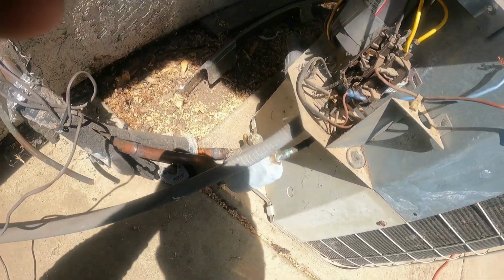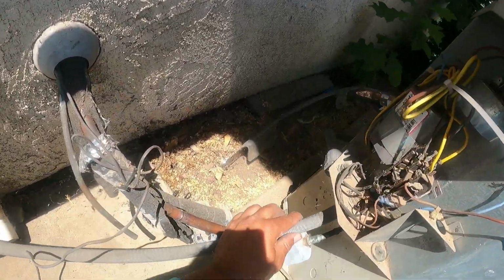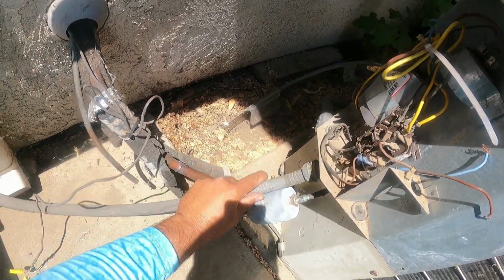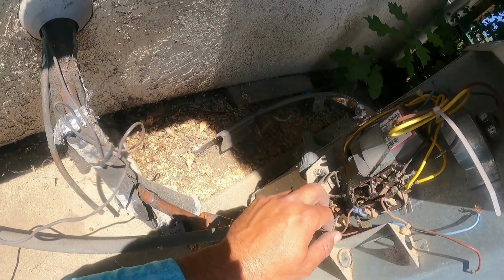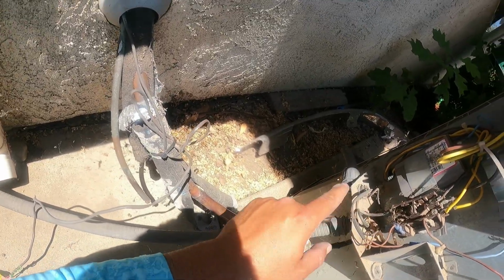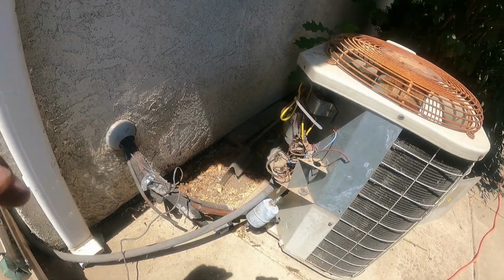So now what we got to do is disconnect the high voltage. So we've got it off. Always double, triple check. So there's a way you get these breakouts. See, this one had just been broken, but you actually take these off a certain way. That was already coming loose like that. So now all we really have to do is take our L1, our L2, and our ground off. So let's do that, and we'll get to work putting the new one in.